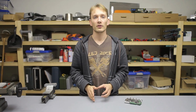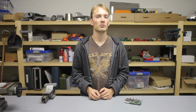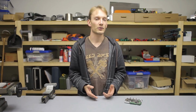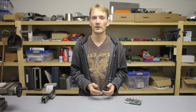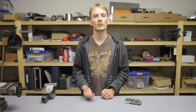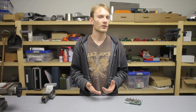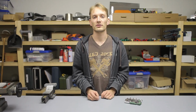Now, I don't want to talk too much about the firmware as that is constantly evolving and not really a part of the board itself, but right now it's pretty much the only firmware that runs on the Smoothieboard. But that's not necessarily a bad thing. Of course, Smoothieware is fully open source just like the Smoothieboard itself, so it can be modified as much as you want, but as of right now it does pretty much anything you'd want it to anyways. Auto bed compensation is there, as is support for many different motion platforms, including stuff like SCARA arms. Then there's support for multiple hot ends, auto PID tuning and automated delta calibration, as well as look-ahead motion planning with similar features to Marlin, temperature control, ATX power supply control, and all the other basic features. Some less used functionality like the grid mode for bed compensation are currently being implemented, so they're not there just yet, but will be very soon. But overall, I think there's very little reason to complain about the feature set of Smoothieware.